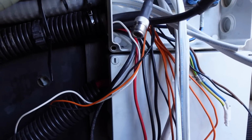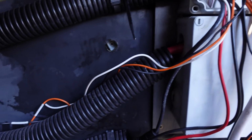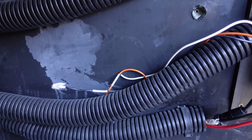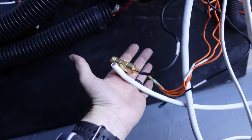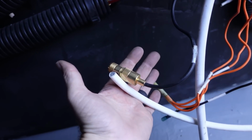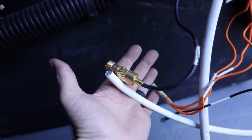The old tricolor light wires I have identified and moved apart, because I'm gonna clip those and label them. Because they're part of a big group of wires, I can't get them out individually, but I don't want to forget what they are if I ever have to come in here again. What else? Because we ran a new VHF coax cable, I'm gonna have to reconnect those, but it's pretty easy to tell which one that is.